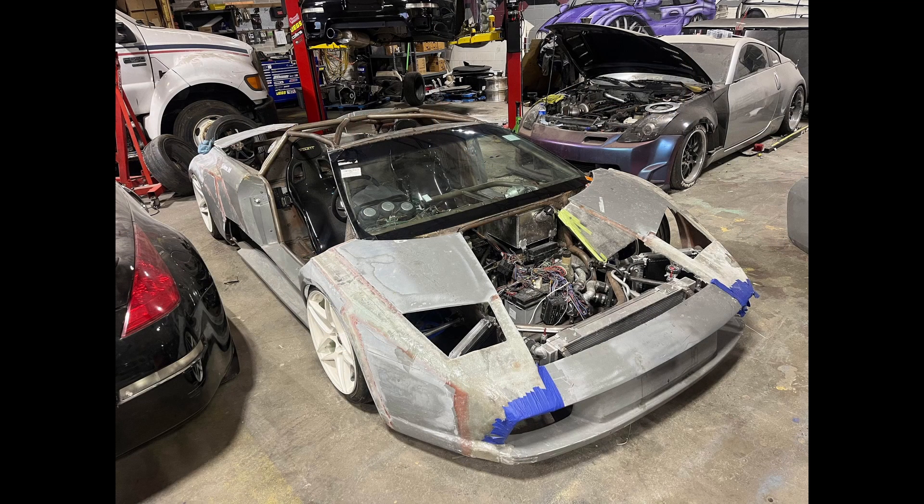Pretty current state of the car — this was just before we took it out and drove it for a couple minutes, giving a buddy of ours a ride. Basically this is the full width that it's going to end up being, pretty much a rough shape of the Infernus, before we actually fit the headlights and get everything else mounted. The wiring in the car is still a pretty big mess. If there's anything I've learned over the years, it's to do the wiring part last on the cleanup — definitely make sure that all the systems work properly before you go through and shorten and loom anything. So we're waiting until we get the headlights and taillights all fully on and functional before we remove all the extra wires and loom all that stuff up and make it look pretty.